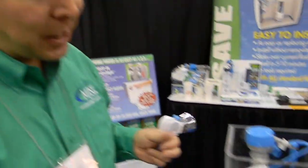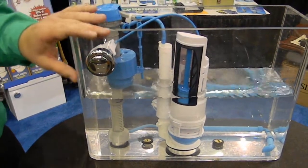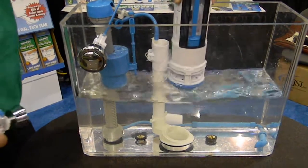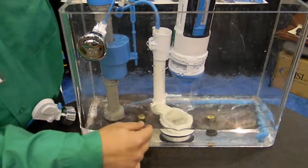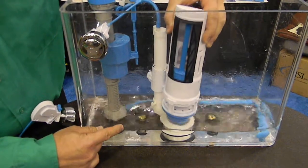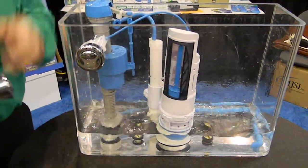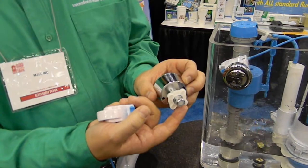So 80% of the time that you're flushing you're using twice as much water as you really need. This allows you to save water and it's incredibly easy to adjust and install. Basically you remove your handle and you remove your flapper — the flapper would normally just sit right here at the bottom — so you just remove the flapper from those ears and this whole unit just drops right over. There's a little clamping device that holds everything down and then this unit right here just mounts right through where your toilet handle was.